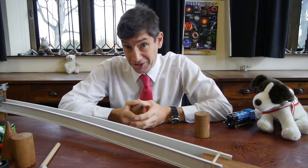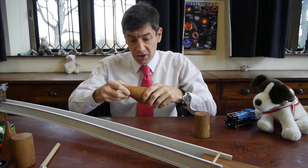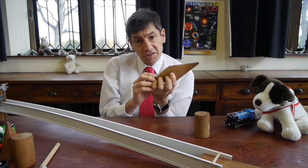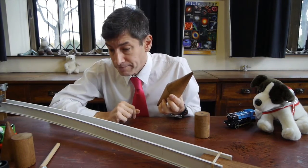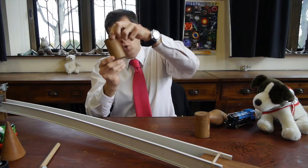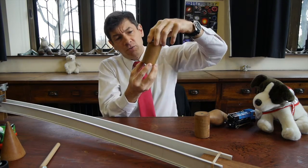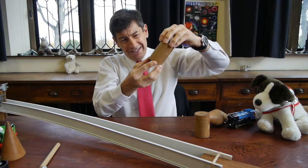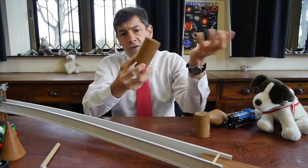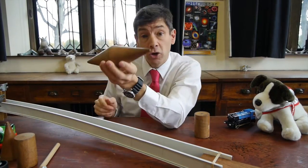The explanation is quite tricky, but here it is. Because the two wheels are joined by a solid axle, however one side turns, the other side turns at the same rate. You can imagine that with flat cylindrical wheels going round a corner, one side would have to travel further than the other — it would skid around the corner. The outside needs to go faster but it can't, because both wheels are rotating at the same rate. So let's now look at the conical wheels.